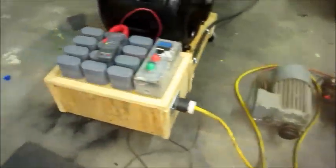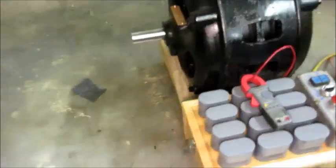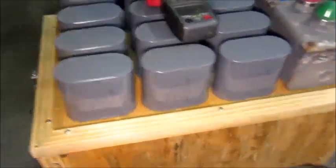It's either going to cause an immediate trip there, or it'll cause such a voltage sag that it causes the control relay inside the phase converter to just turn off. So we're going to find out shortly.